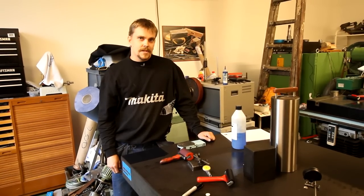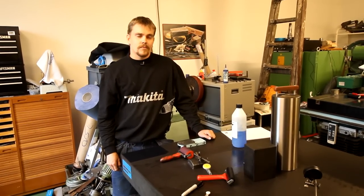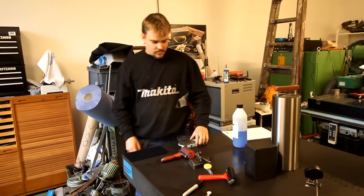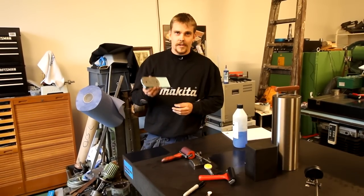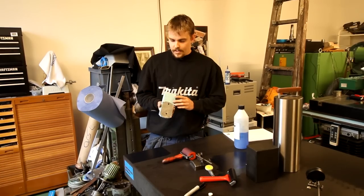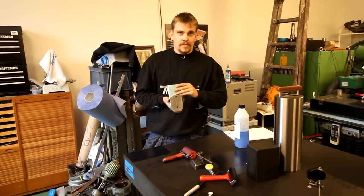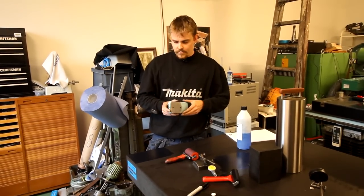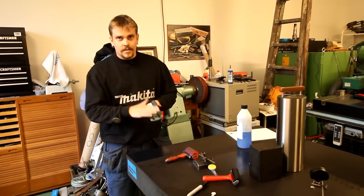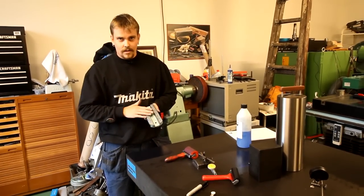Hello, my name is Henning Jonsson. I run a one-man machine shop for a living. I'm helping out our great host here, Lauritz, with his small Atlas shaper. This is the compound, it's called maybe, for the tools to go up and down. What I'm doing here is trying to make these two planes flat and parallel.